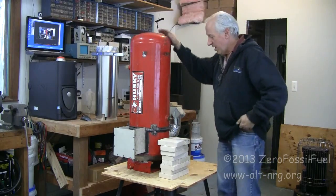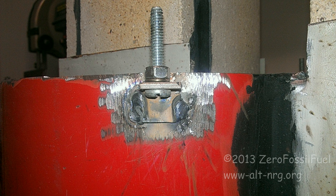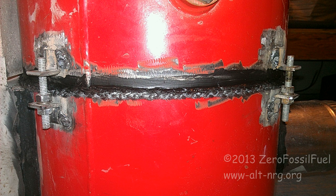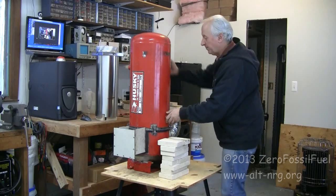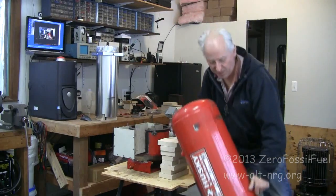Getting right into the disassembly — as you'll see in this photo, I welded four brackets to the sides of the tank where I split the tank, and there are four quarter-inch by 20 thread studs that go through and just align with the top bracket that's welded onto the top half of the tank. They were welded in place with the screws tightened so that you can get them aligned properly vertically so that the tank will just slip right on top of the threads for the studs. Moving the top — it comes right off.